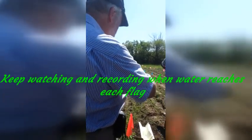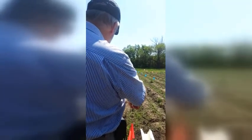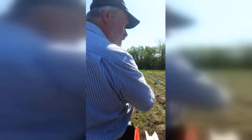Whenever those times are recorded, you also check the discharge here — by making the measurements of the level. Record the discharge at the same time. It's advised that one person remains here always making the reading of the flume. You can take readings at least every 10 seconds, or once it becomes stable. We can also have a constant time gap, for example every one minute or so. But that also has to be recorded when the water is reaching the flags at the same time. Also record when the flow is reaching the other end, and the discharge has to be measured on the other end as well.